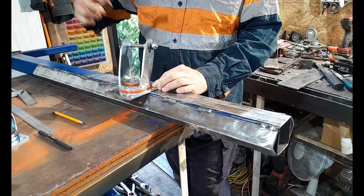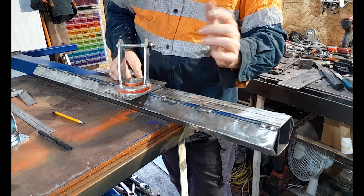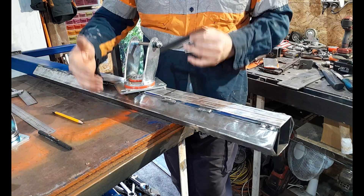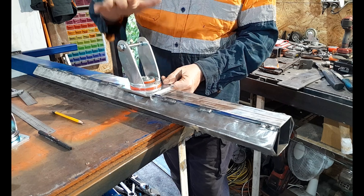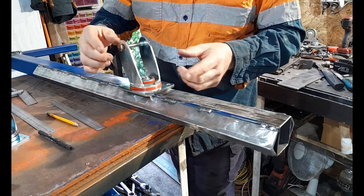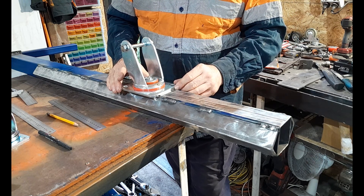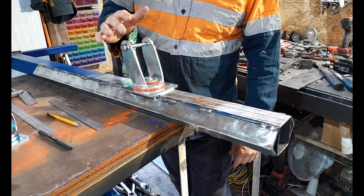The bottom plate of this caster is 6 millimeters thick, and it's a 6 millimeter thick caster frame for the wheel — that gives you an idea of how heavy duty it is. This is needed because it does have to put up with quite a bit of side load when the motion sim goes through its roll axis. Casters are generally not rated so much for side load. This is 300 kilogram rated, but I noticed this is exactly the same caster as my 225 kilogram rated caster on the old 3-degree-of-freedom motion sim — just a longer frame to take a larger 150 millimeter wheel.